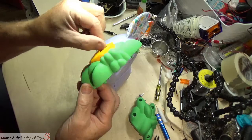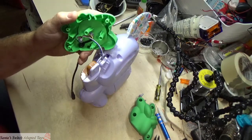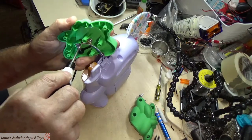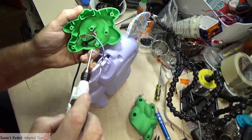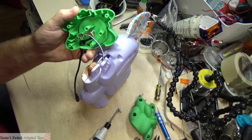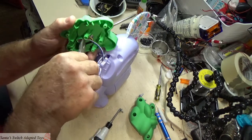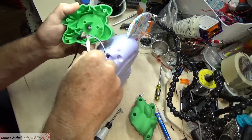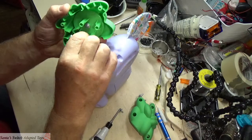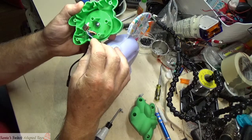This switch is activated by this dial. I'm going to take that switch out — you need to do this anyway to be able to solder the connections on. I use needle-nose pliers and grab across the connections to pull it out. I've already made up my stereo cable to be a mono cable in advance.